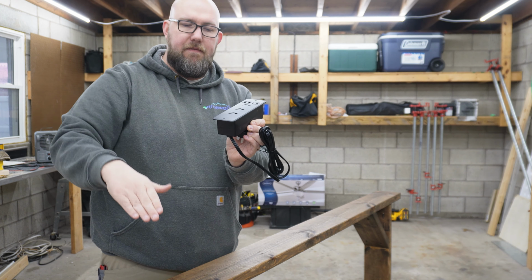I have a 3-section couch, it's a sectional, and there's 3 sections. It's going to be centered in the middle of one, so you can basically get power from any of the positions, rather than it being more to one side or the other. It's going to be centered in the middle one, which leaves it at about 1'5" to the center of this. So we'll have to measure that all out, and then we'll cut this guy in.